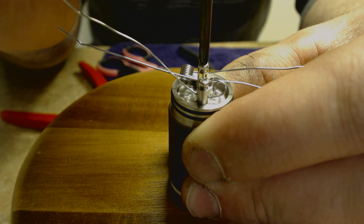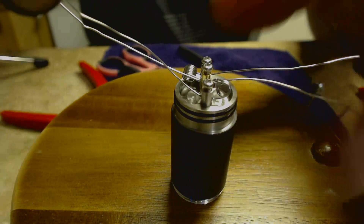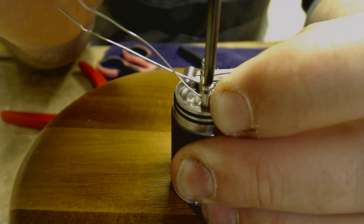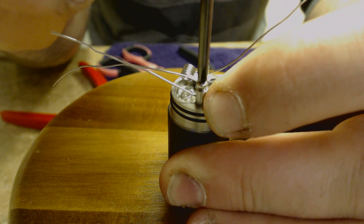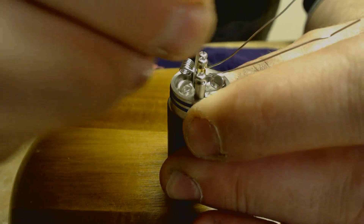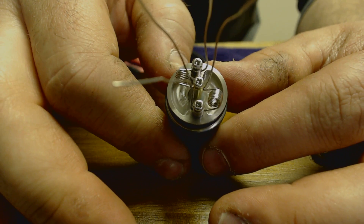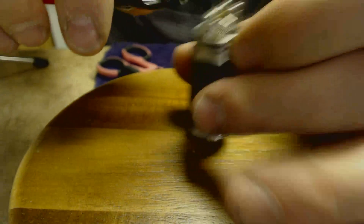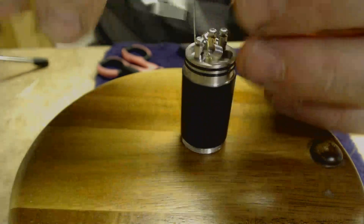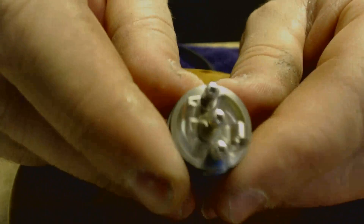I've got my leads inside the positive post, laying right next to each other. As far as spinning center posts go, I haven't had that issue yet, which makes me really happy. I'm going to snug up the negatives one more time, lift everything to the sky, and really wrap those leads around the screw. Let's do a little chop here — choppy chop. Keep a hold of the clippings, you don't want them on the floor.